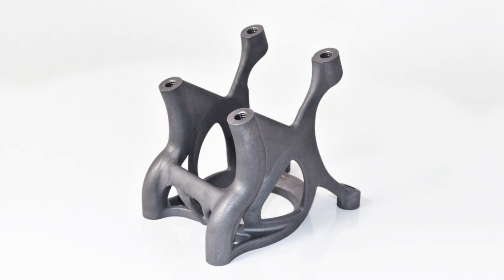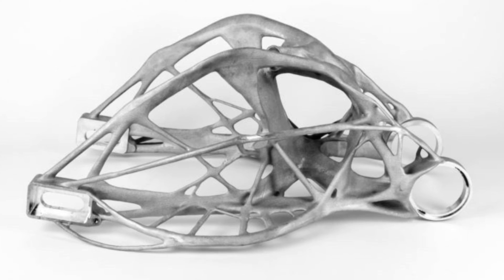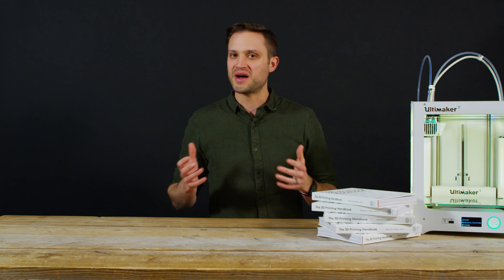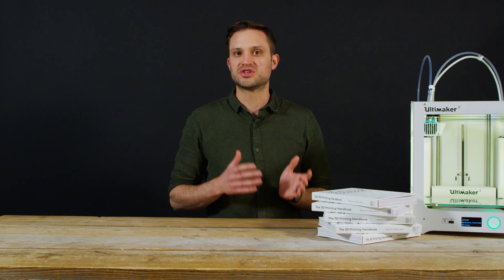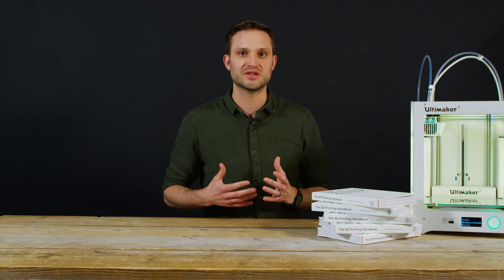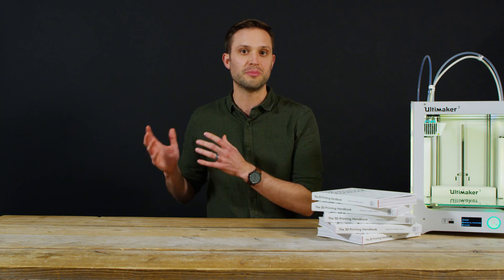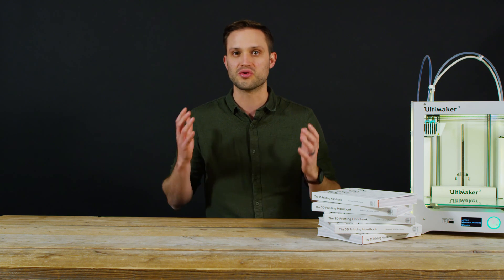Other new CAD techniques like topology optimization and generative design are also perfect to utilize with metal 3D printing. One important thing to keep in mind is whether all parts of your design actually need to be metal 3D printed. Often it's better to choose a traditional manufacturing technology like CNC for some of the more basic sections and then use 3D printing for the complex parts, assembling these all together at the end — this can save a lot on the overall cost of your design. For specific design rules, we've got a link in the description below that covers everything you need to know.